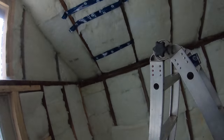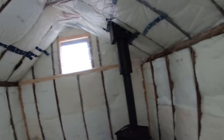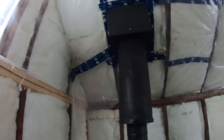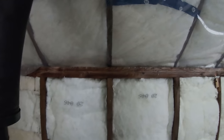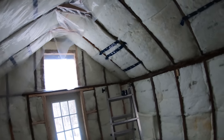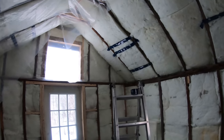Here's where we're at on the insulation — I put the triangular sections in first, then the sheet on the rafters overlapping it, and we'll seal it up on the gable ends. Now I'm putting another sheet about 16 feet long across the main span. I've cut out my cathedral ceiling kit and sealed that all up. Lining it up at the bottoms of the rafters — it's an 8-foot roll for an 8-foot-high wall — so that'll seal everything up nicely.